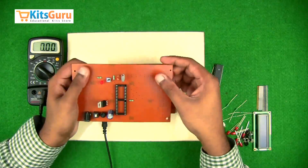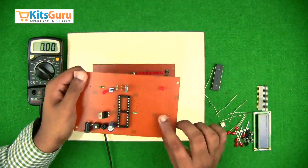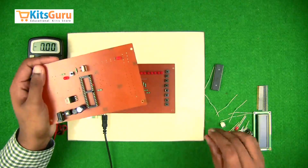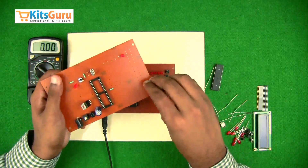The longer stem of each LED should be on the outer side — each LED must be fixed with the positive terminal on the outer side. As you can see, there are also a number of microswitches used here, and each microswitch is inserted accordingly.